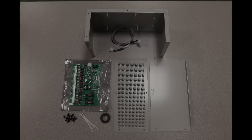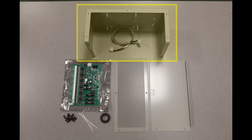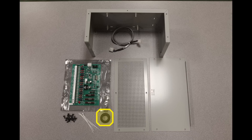Upon opening the field kit, please inspect and check for the following items: an auxiliary relay alarm card, a serial interconnection cable assembly, an AT10.1 penthouse shroud with four factory-installed PC board standoffs, an AT10.1 penthouse top, an AT10.1 penthouse blank panel, one rubber grommet, six plastic wire ties, and fourteen self-tapping screws.